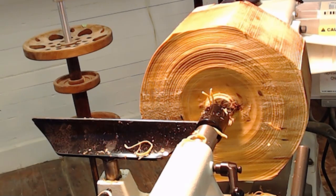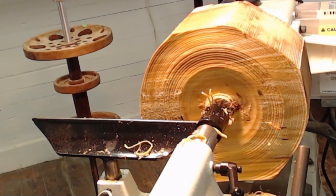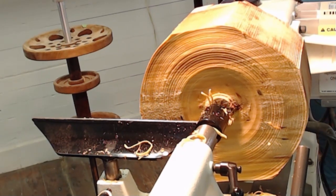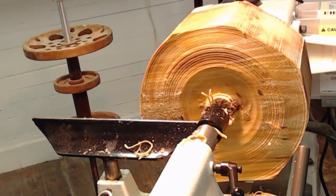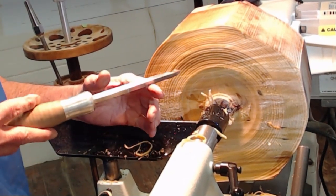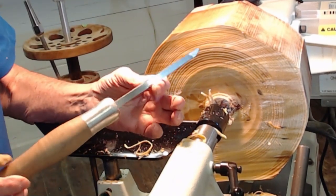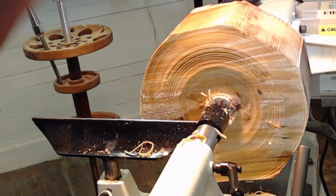On this chuck, I need to go at least about 5.5 inches to expand into it. I'm going to pass this around later too, so you can see it when I get through with it. It's simply a 3/8 steel rod, a piece of tool steel for a metal lathe, and I've ground it at an edge that allows me to get back in there and establish my dovetail.